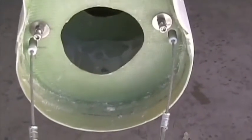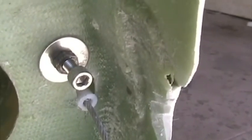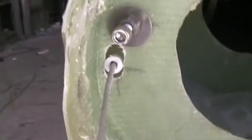Here I'm busy installing the rudder, and I've put in the rudder stops. There's a 6mm cap screw with a large washer either side of the spar, with a plain nut this side and a nylock nut on the inside. And directly below that is the Teflon tube. You can see I've had to slot it to allow it to move as the rudder hinges. You can see the relative position between the two.